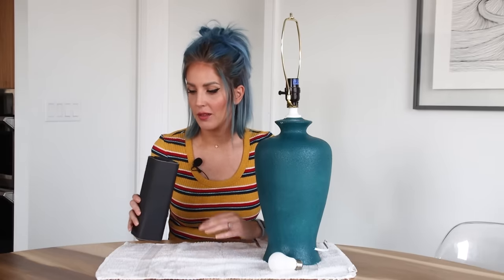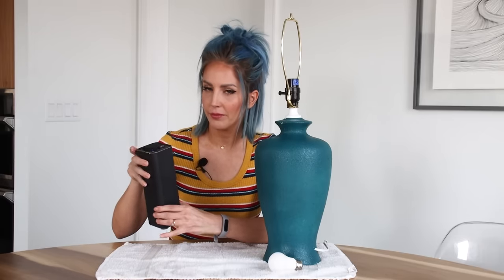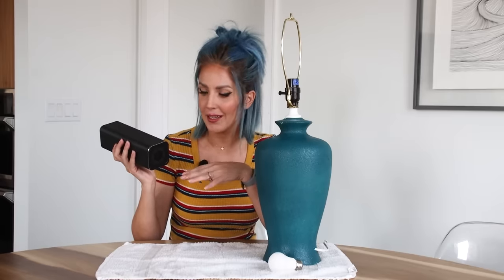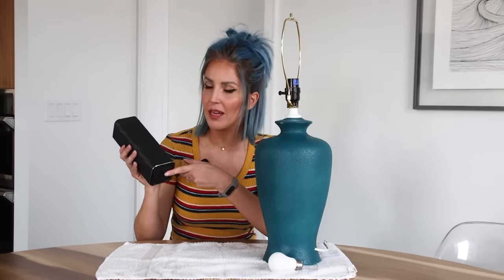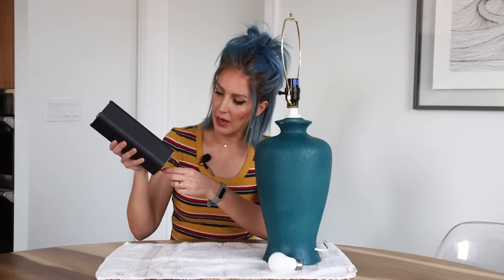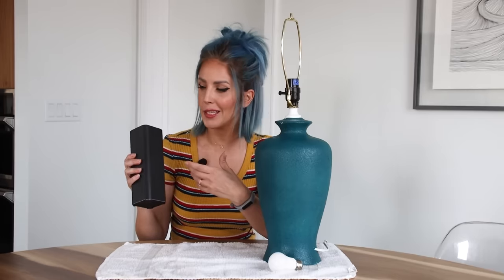The biggest negative about using a power bank with a built-in inverter is the noise. It has a fan on the bottom that spins the entire time it's on. This fan cannot be obstructed — ideally it needs to be exposed to open air, otherwise the entire power bank can overheat and fail. Something inconvenient with this specific power bank is the fact that the fan is opposite the plug and the power button. So if I inserted it into my lamp this way to make it easy to plug in and turn on, the fan won't have good air circulation. It's stupid easy to use though.